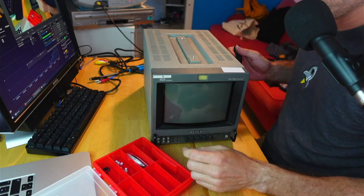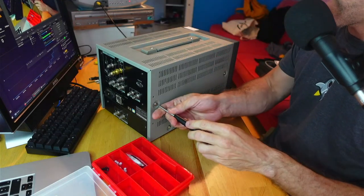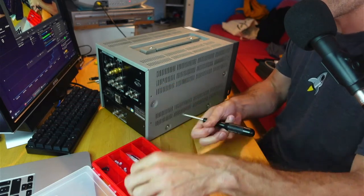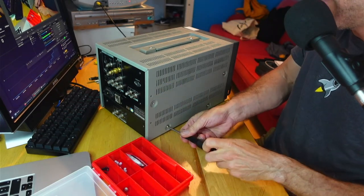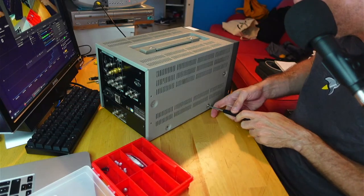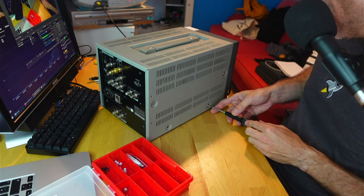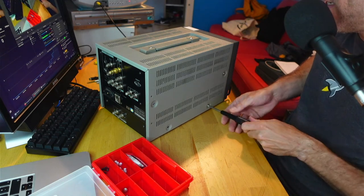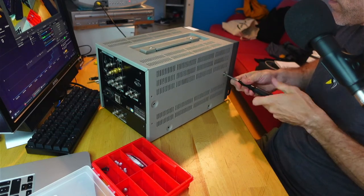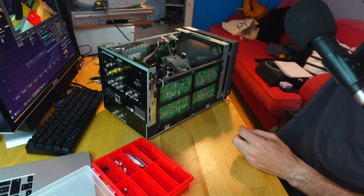Yes, yeah, Steve, I was explaining earlier that there is an official Sony service bulletin that says you've got to replace these variable capacitors, add in a couple of some other components, but just reflowing the points works. So, let's grab that. All right, lid off.